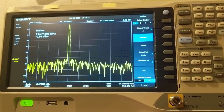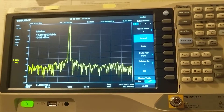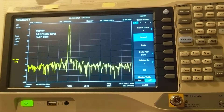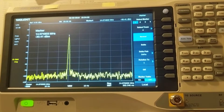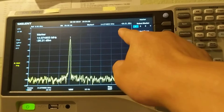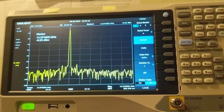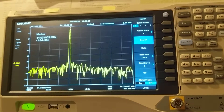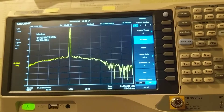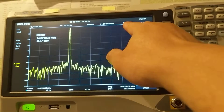Let me go lower so you can see what I'm doing. This is zero USB mod — it's 26dB down. If I increase the mod level, it's increasing. Then at 45, it's a cutoff. After 45, right now it's over 45 — it's 0.77 dBm.